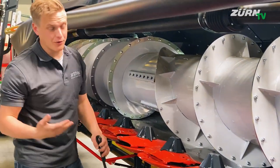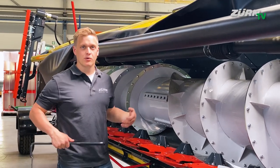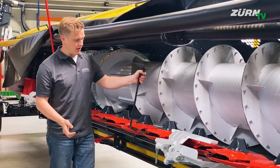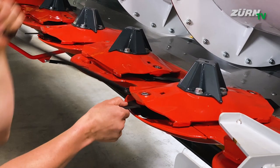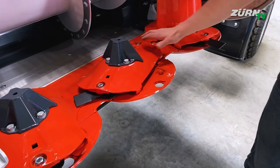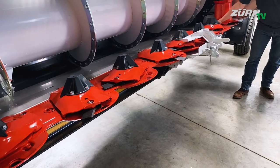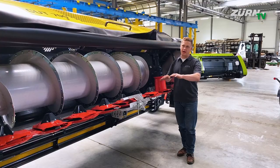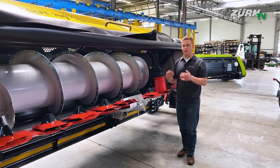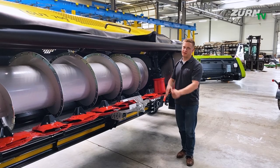There is an overload breakaway system for every individual disc, but also a knife quick change system. There's a lever which you can simply push in behind the knife and pull it down to release the blade. The Kuhn mower bar is lubricated for a lifetime and has very little play between the individual discs, so we can synchronize the two bars perfectly, with the drives outside where they don't disturb the crop flow without any risk of collisions in the center.